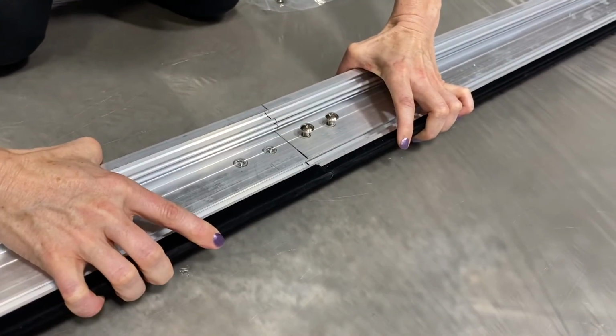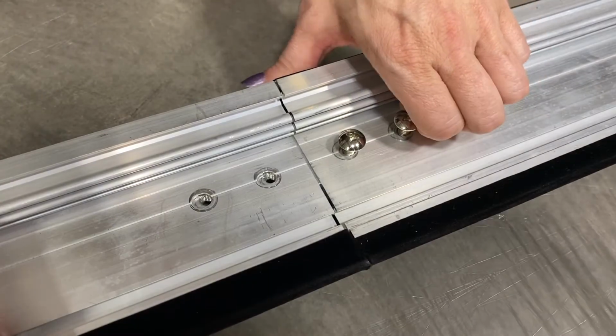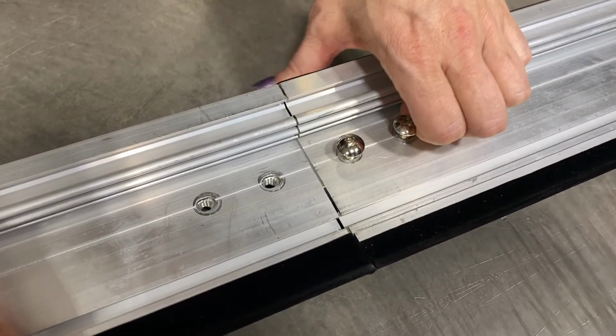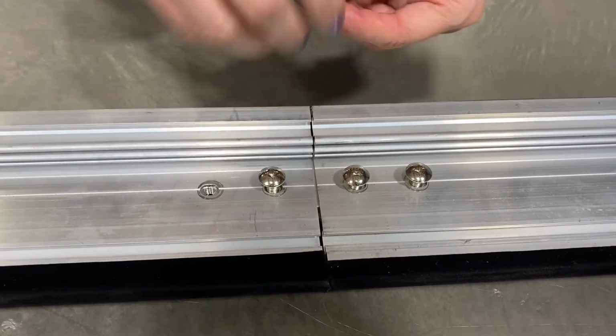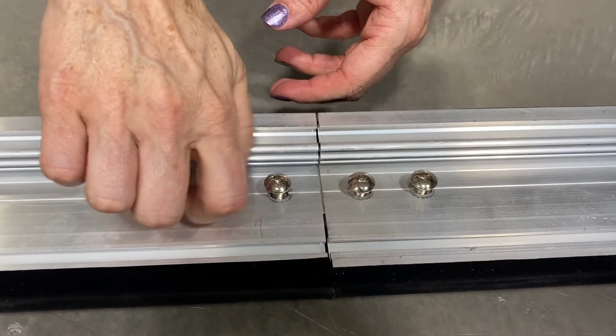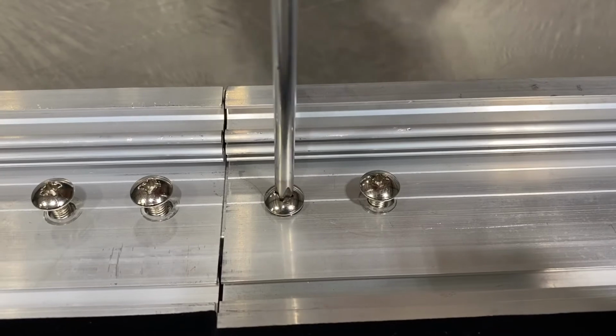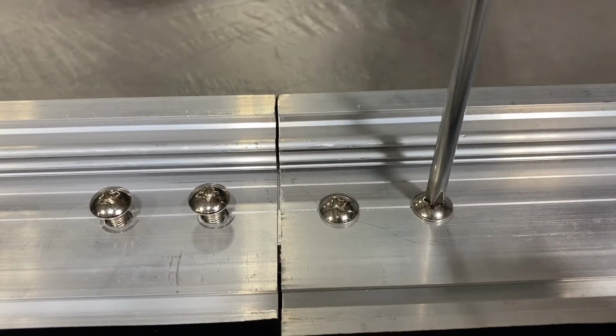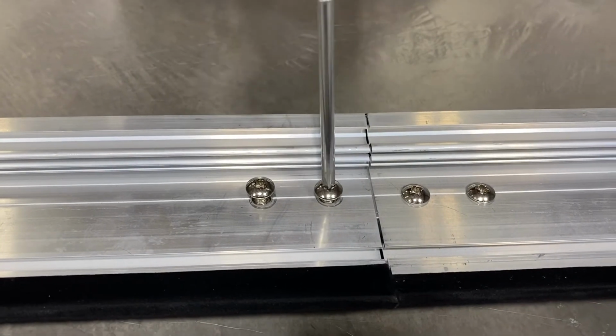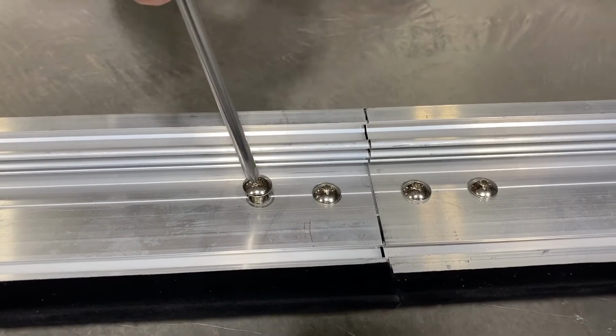Join the other frame pieces to make the top and bottom frame rails. Align the screw holes as shown. Add the remaining screws to the top and bottom frame rails by hand. Press the frame pieces together to make sure the joint is nice and tight, and tighten the screws. After the top and bottom rails are formed, there will be 4 frame pieces ready to assemble.